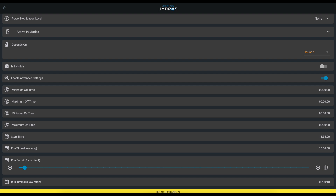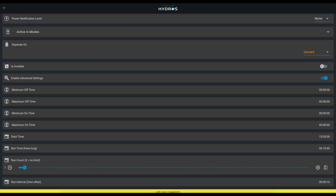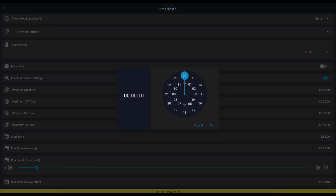The barrel that mixes the food should turn on at 13:55, that way it's on five minutes before the auger, which runs at 2:00. Do you want it to repeat? Let's have it run again at around 6:00. So the run time is 10 minutes, run count is two, and the run interval is five hours. Then upload changes.